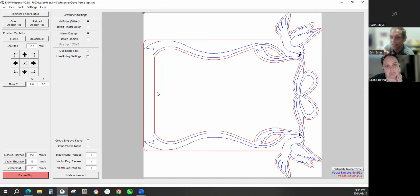So in 90%, it doesn't engrave the full thing black. It only engraves 90% of that thing, but still at the same speed and temperature that your machine set up. And so it does for 80. So it kind of fakes the temperature settings that more clever software would normally do. When you use different colors, it'll actually tell your machine to use different speeds and different settings. This doesn't do that. It's literally an algorithm that's running to help you out, and that's why the grayscale images work so well.